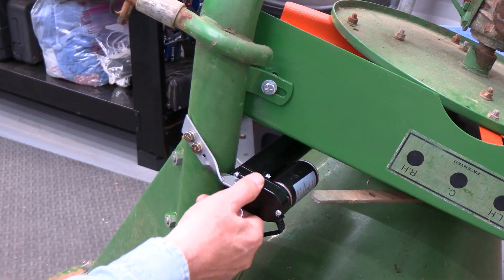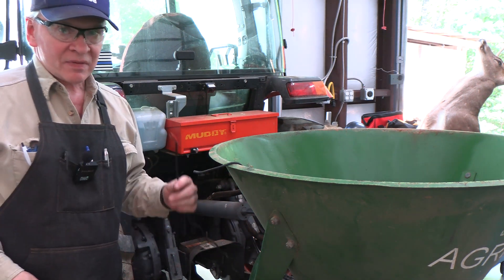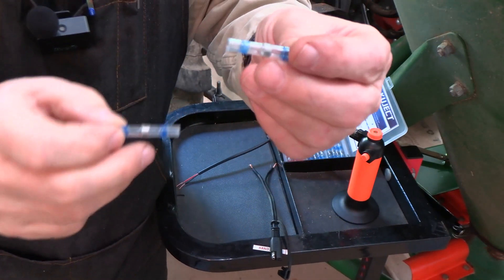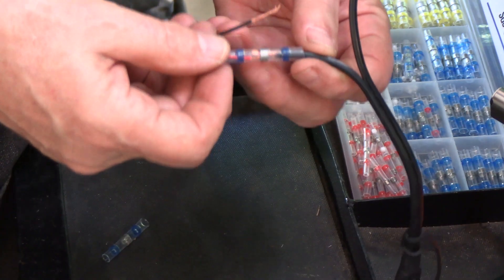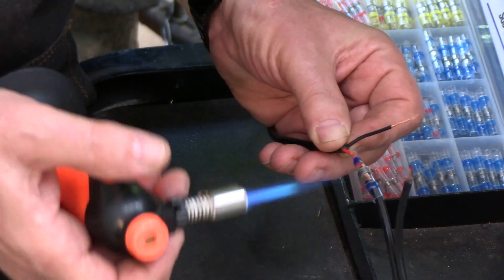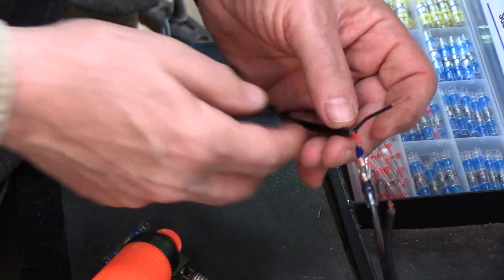Fully closed — so that's a good solid fix. Now it's just time to hook it up to the tractor and do the wiring. I've got the spreader now mounted onto my tractor, and these are the wires that come out of the actuator. I want to hook it up to one of these connectors. When the wires are in here, the central part is soldered — that will melt and solder the wires together. These ends are shrink-wrapped, so it'll make a watertight seal. If the wires overlap in the center, then when we heat it you can see it shrinking — a good shrink wrap — and then the solder melts. And that's a beautiful seal.